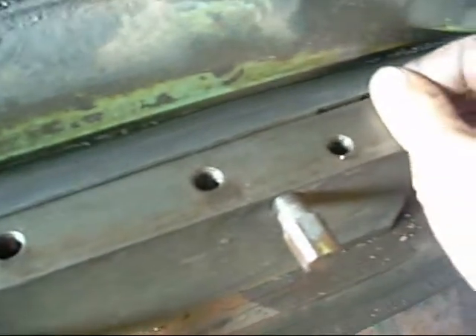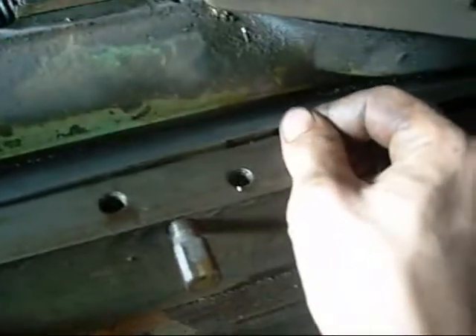I've got most of the swarf going and I'm pulling this turret slide off. This thing here is a gib strip. You use that screw there to push it in a little bit and it just snugs up against the slide and prevents any slop, free play — that sort of thing.